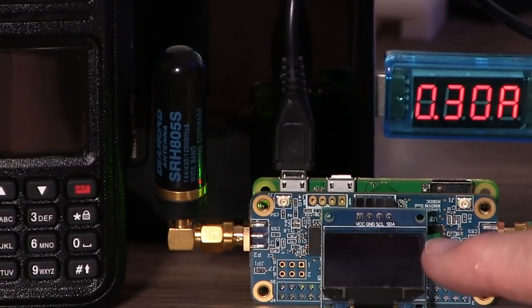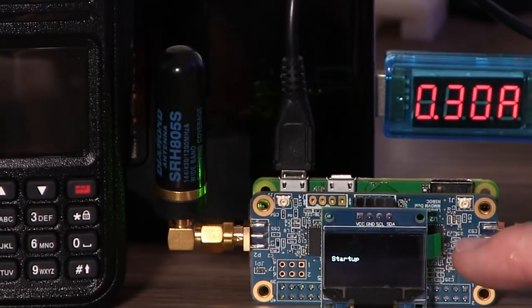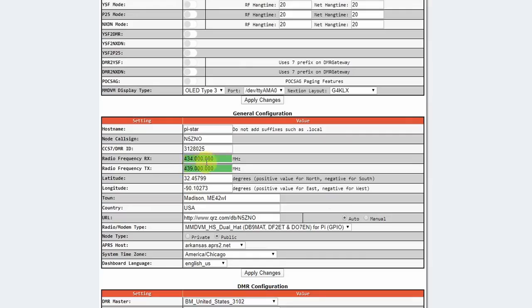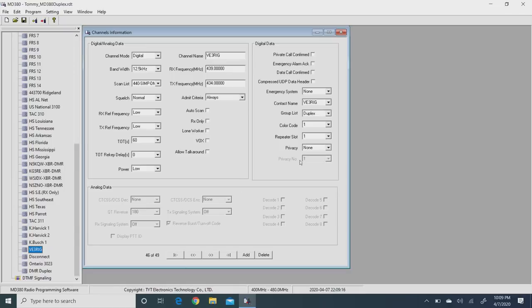And you can see down here on the display, it says "close, start up," so it's booting up. Now this does support other displays, and I'll show you that in just a moment. Still using the same frequencies for DMR. If you look here, you'll see how I set up my channels on DMR on the radio. You can actually have two connections going at one time on two different time slots. So if you look here, I've got Mike's repeater on one of them, and then I've got pretty much everything else on the other.